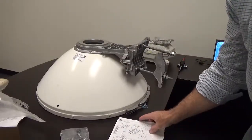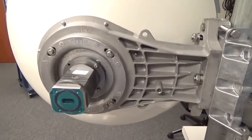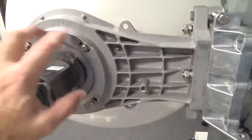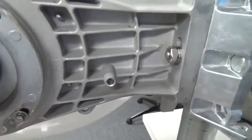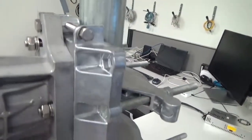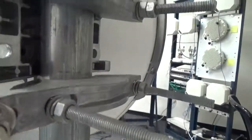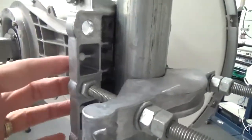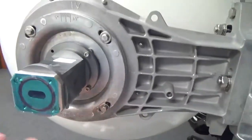The next step is mounting this on a pole. Here we have a pole mount — this is a waveguide component. Normally it would have a standard radio attached. You can see there's a plus or minus five degree adjustment here, and by loosening these bolts and adjusting, you can adjust polarization so it's level. You can see the vertical and horizontal markings, and as the bracket is attached to the pole, the V-bracket is on the bottom, the center pipe mount bracket attaches through the component bolted to the antenna, and the radio attaches off the back end.